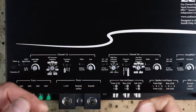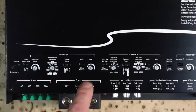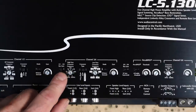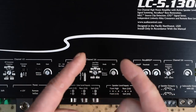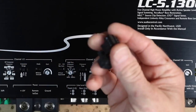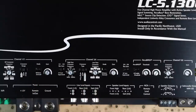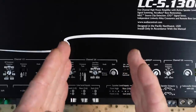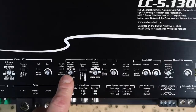If you're going to use an external DSP, just leave the crossover off. Moving on to channel 3 — the first thing to notice is the sum for channels 1 and 2 to 3 and 4. If we're only using inputs 1 and 2, it'll do the summing internally and inputs 1 and 2 will now feed inputs 3 and 4. So I can use channels 3 and 4 for mid-bass and channels 1 and 2 for tweeter. Because of that, channel 3 has a bandpass crossover built into it.